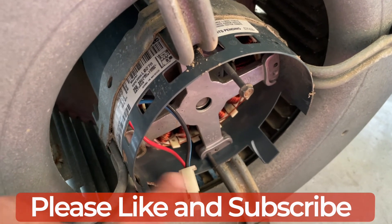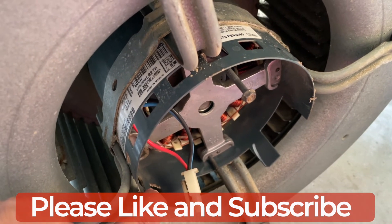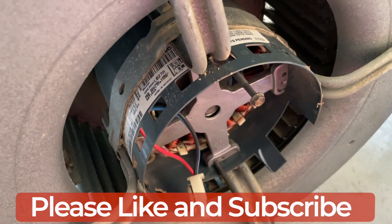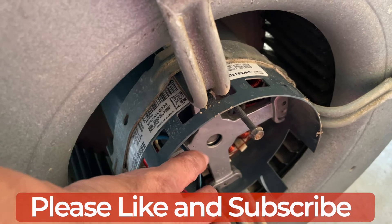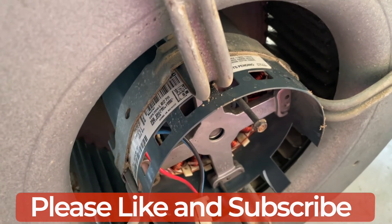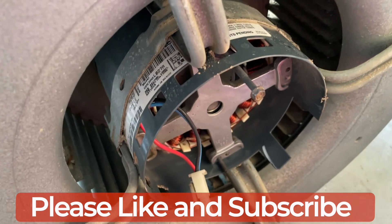Those are the signs of a bad ECM. You can fix it - if it's completely not working it most likely is your thermistor and you can replace it to get it moving. In some cases the thermistor trick doesn't work and you have to replace the whole ECM. Hopefully you liked the video - if so please subscribe to my channel and like the video, thank you.